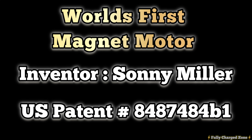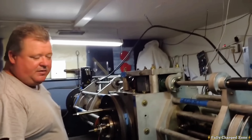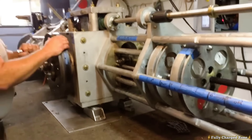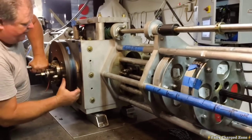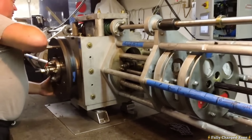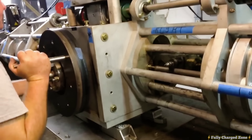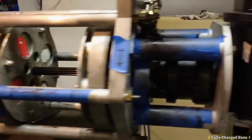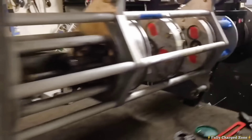I think this guy is pretty amazing. We're set in electronic timing mode. As you can see, the wheels move at the same time. And now with the electronic timing mode, I'm going to show you where our timing tape is. We are coming around, going around to top dead center, which is right there at my top dead center mark. And Marco will go ahead and show them the timing. I'm advanced to 30 degrees on the timing wheels. Timing tape there at 30, and on this side, timing tape at 30.